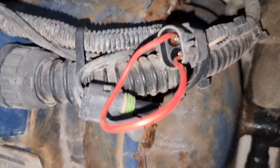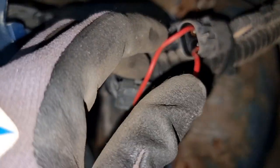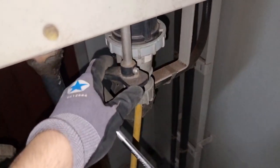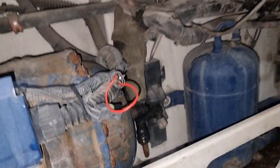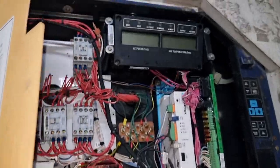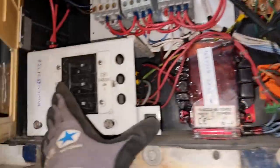And then I need to reset the alarm from our controller, the high pressure switch alarm 58, since it is still activated because the safety system on the condenser was activated also. So I will let the unit run and check if the condenser fan will also run.